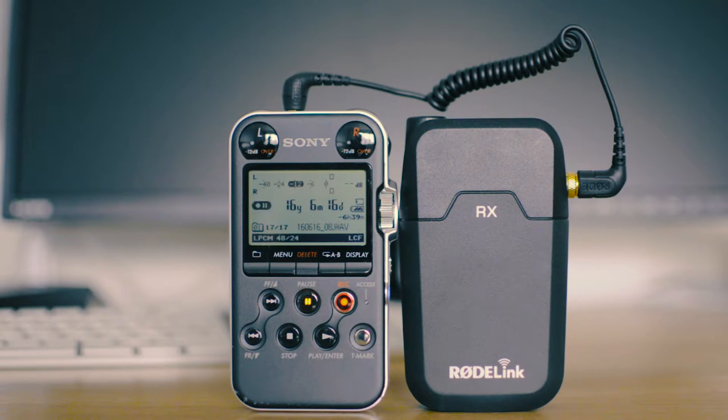Somewhere with lots of Wi-Fi hotspots could interfere with it, but it holds its connection very, very well. It's very easy to set up and you're straight off to the races. I definitely recommend running into an audio recorder for most production audio, as these are always going to produce better quality than the vast majority of DSLRs. Higher-end cameras like the C100, C500, or Red have fairly decent preamps, but DSLRs usually don't because they're smaller and can't fit that in. For example, my Nikon D5100 has very limited video and audio controls — basically just low, medium, and high audio levels.